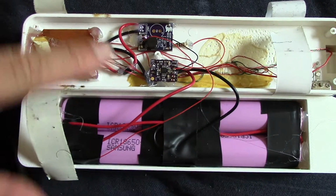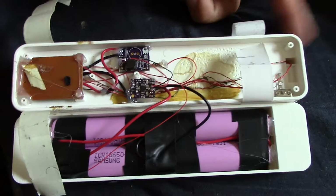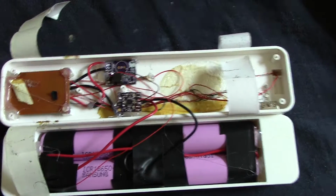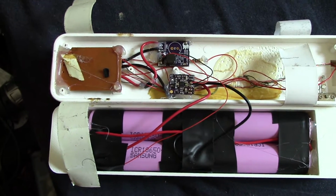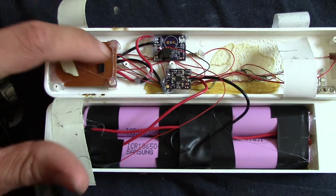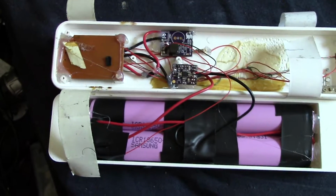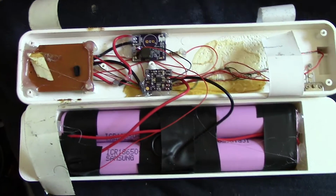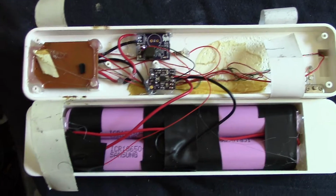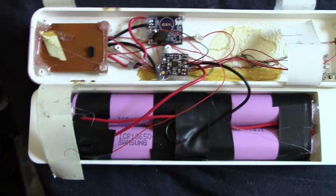And the battery has to be tied directly to this, because otherwise that touch sensor, that's what turns it on. And so if I didn't do that, then I'd have to come up with, it'd be pretty hard, actually, because that circuit is an all-in-one kind of circuit. It has the latching circuitry and the capacitive touch circuitry built into the same chip, so you pretty much have to power it to turn that off and on if you want to use the original off and on touch sensor, which you kind of have to.